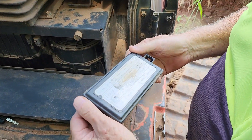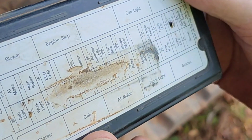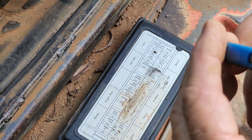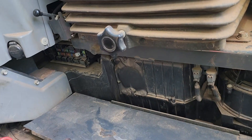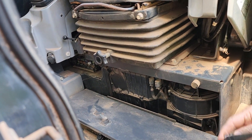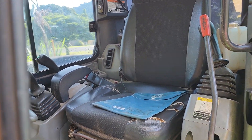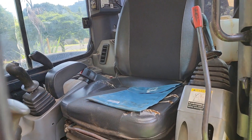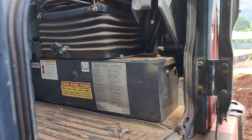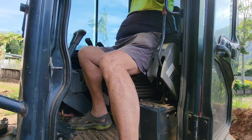Okay, so let's have a look. Check all the things there. Just check the fuses and look for any blown ones. If you find one, just replace it — hopefully that will get the hydraulics working, because the engine starts but the hydraulics don't function. It didn't look like anything was wrong, but I'll secure it and have a go. We jiggled the fuses a little bit.